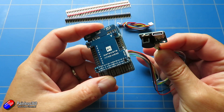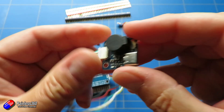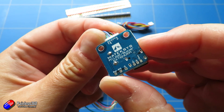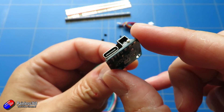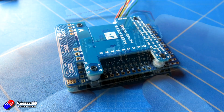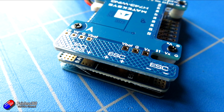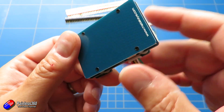Here it is in the flesh. The main board itself looks familiar. There's this little doohickey on the side that is a bit more unusual - there is a piezoelectric buzzer on here, and also the USB port, which is a modern USB port - really nice to see. The buzzer can also be enabled and disabled with a little switch. I really like this design because you often have to hide the flight controller in the middle of your wing, and being able to locate the daughter board somewhere else - where the buzzer is away from the magnetic and compass stuff - is great. You can also turn it off and have easy access to the USB port.